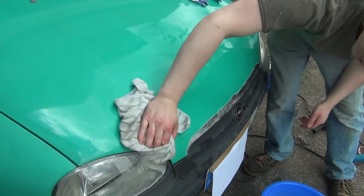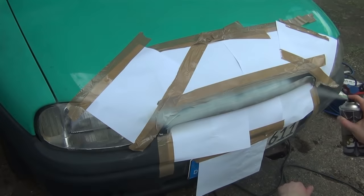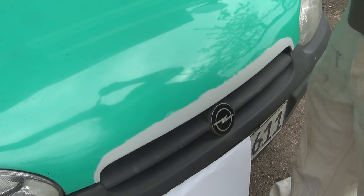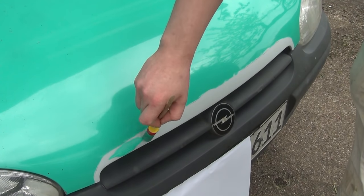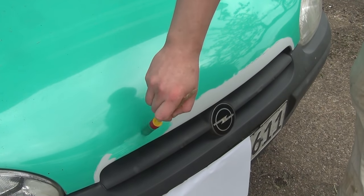Then the bare metal is washed, dried and masked with some paper and some tape. I just use what I have lying around. Then I spray some primer onto the surfaces. After the primer has dried, I apply some mint green paint onto it. Doing it this way with an ordinary brush is of course not the way to go if you want to restore some valuable old timer. But for stopping the rust on an old cheapo like this one, it will suffice.